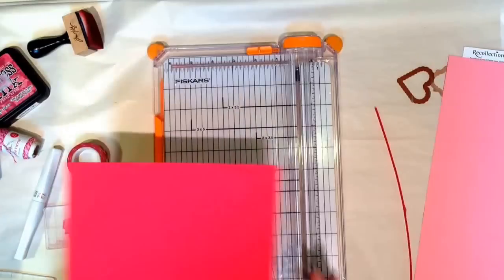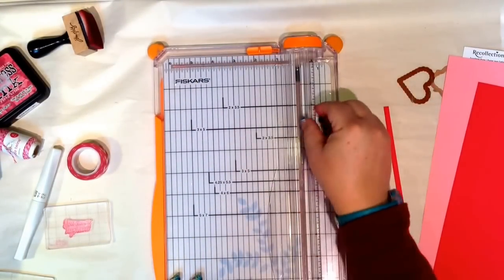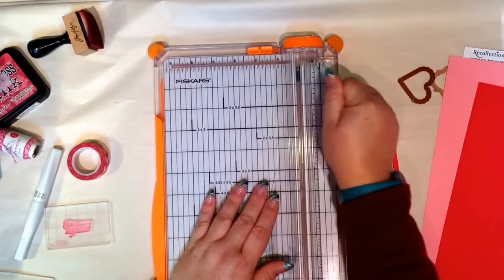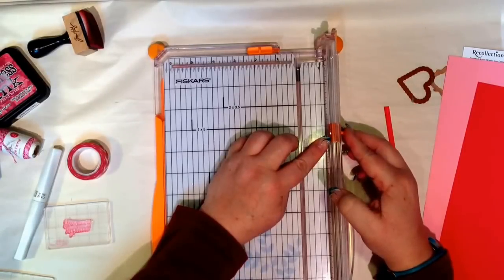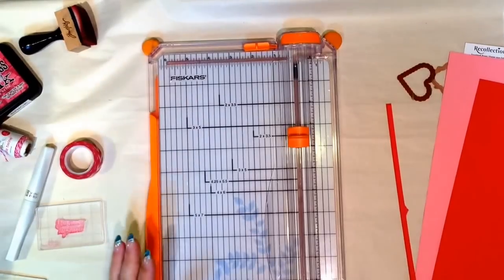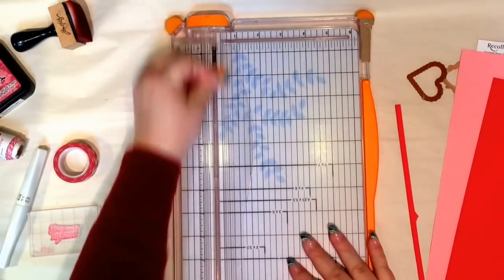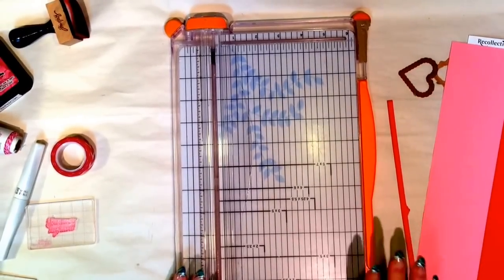Different cutters are going to act differently on you. It all depends. But for me, I have found that pulling the blade to one side or the other is good. With this one, a lot of people are saying how their wire gets frayed and everything else. That's because you're pulling it to the right. Normally that would be fine, but when you pull it to the right, the edge of your blade that's running against the wire is actually running hard against the wire, and it's cutting your wire. That's why your wires are breaking. So stop doing that. Try pulling it to the left if you can. If you are left-handed or whatever else, then push it in to the right and do it that way. Typically that's how I do it. I just, for showing sake, showed you the right-handed way. Alrighty, I hope that helps.